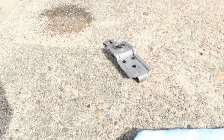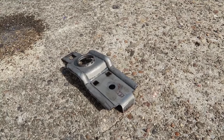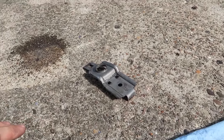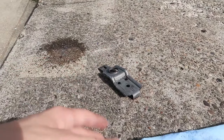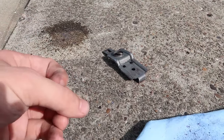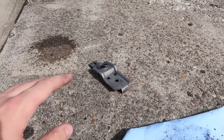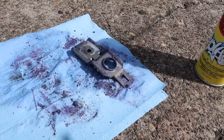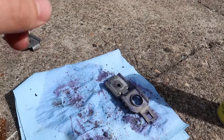After going over it with the paint thinner, a brush, a degreaser, and some shop towels, I'm pretty much left with mostly bare metal. I did sand off most of the old paint. This isn't going to be perfect — it's just to get it down so there's nothing that's going to come off. I'm going to let this guy sit and dry out, do the same thing to the other one, and then we'll be able to prime these.